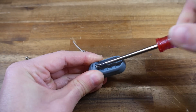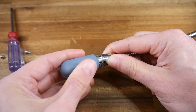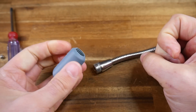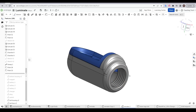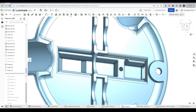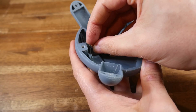Unfortunately, the bore for the retaining screw was a little bit too narrow, which cracked the housing. And the base diameter for the thread underneath was also too small, making it impossible to screw the housing onto the gooseneck — the housing was starting to crack from being too tight. The beauty of 3D printing means it's easy to iterate and make changes. So I expanded the holes for the LEDs, expanded the hole for the thread and added a little bit more meat around it, widened the trench in the lower housing to allow the charger to fit in nicely, and offset the battery holder to make it easier to lever the charger into position. After a few more tweaks, I was ready to reprint.